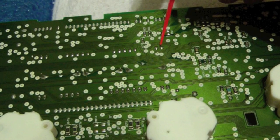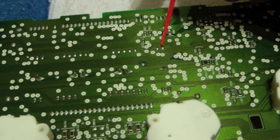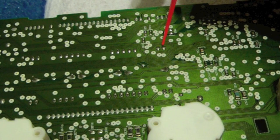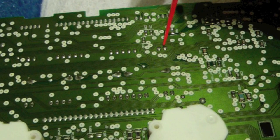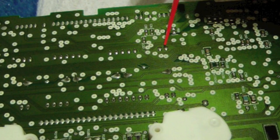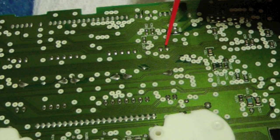The solder process is pretty straightforward. You've got to heat your soldering iron up to full heat, then hold it against the connector and it should heat up really quick. Then just touch your solder to the hot connector and it should melt a little bit of solder onto there. But it's got to be a quick and precise process.